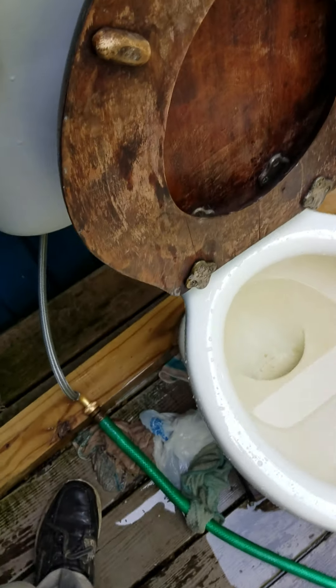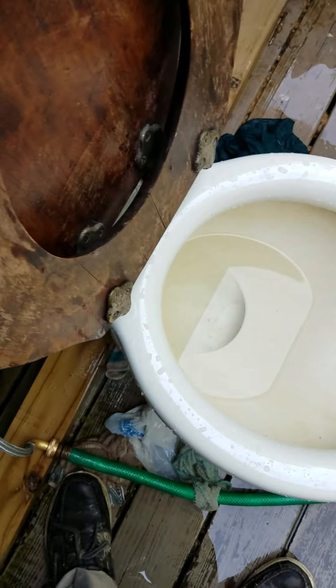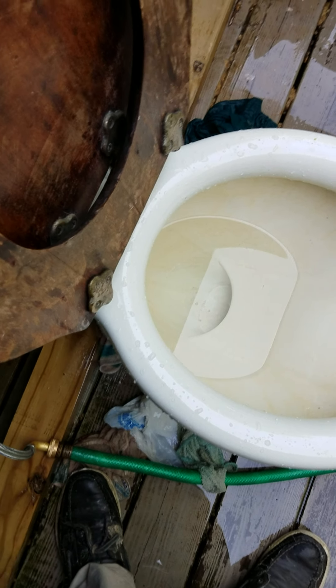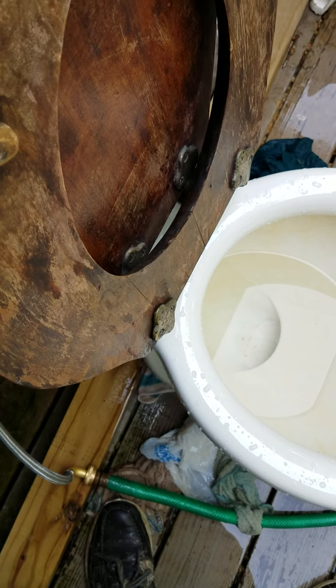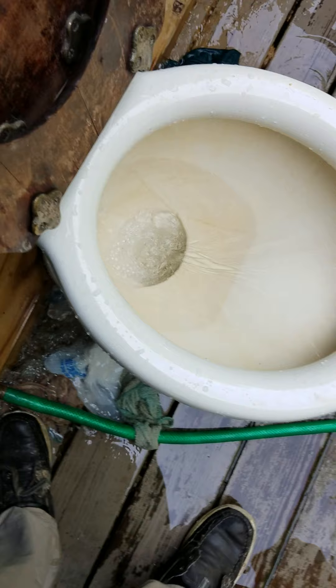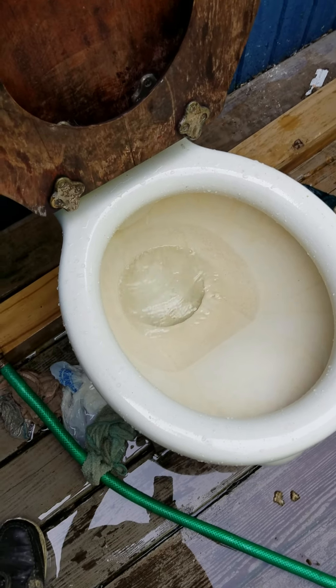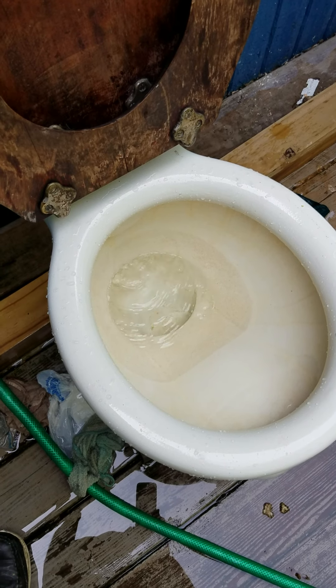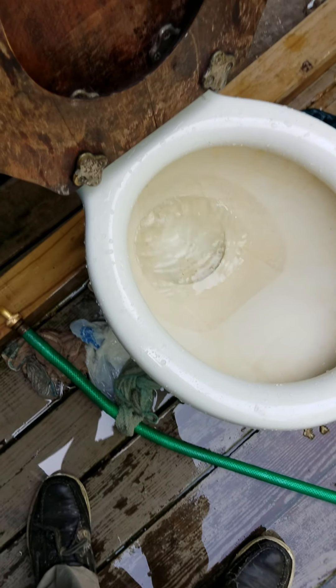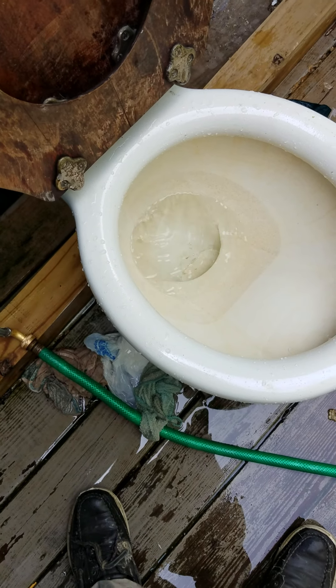I did the overfilled tank test and there's a bunch of water dripping underneath it right now because there's still water on the back of it. Anyway, here's the flush on 1.6 — I manually closed the valve at a certain level. That's about 1.6 gallons, give or take maybe 0.1 of a gallon each time because I have to stop it at the same spot. I did a test to make sure it was 1.6 and it is.